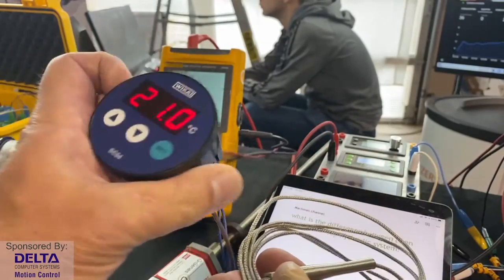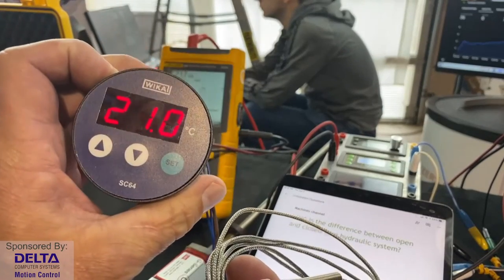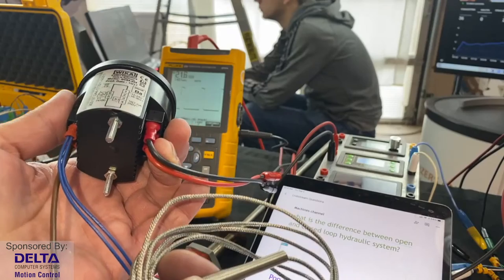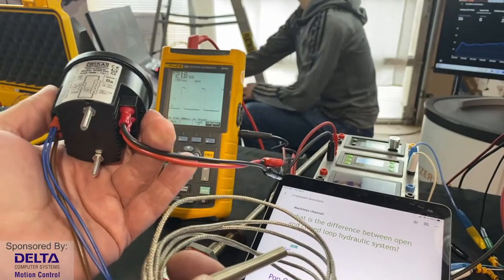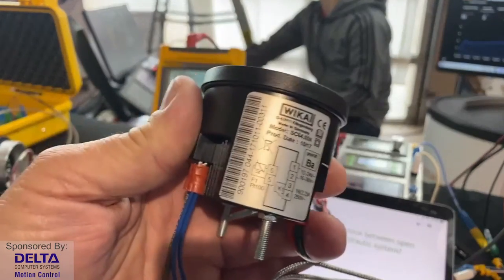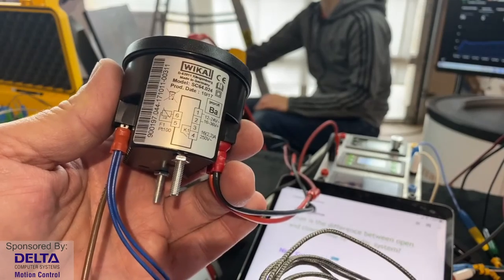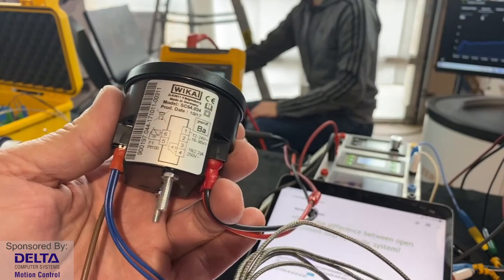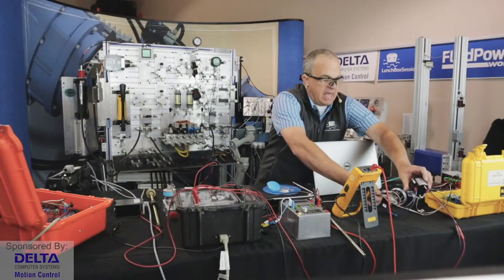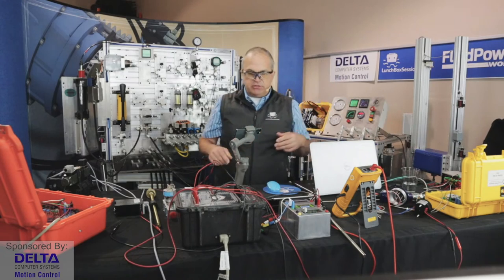And then, just giving us a readout of the temperature here in the room, which can read out in Celsius, or the program can be changed to give the temperature in Fahrenheit as well. And so that's a great application. It's just powered by 24 volts DC and easy to use. And it's not just a temperature readout. You could choose to use the relay contact as well and then use it as a controller to trigger cooling or heating. So that's a very typical type of application for RTDs in use to measure temperature.